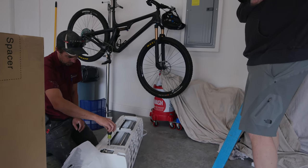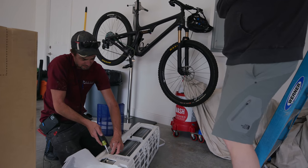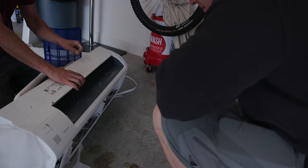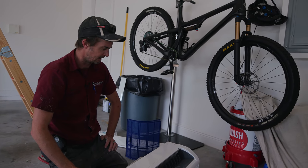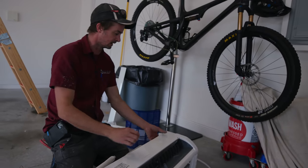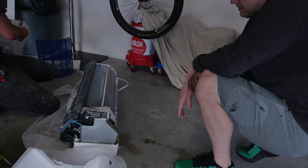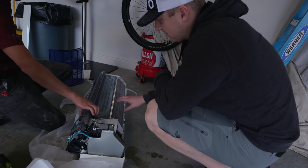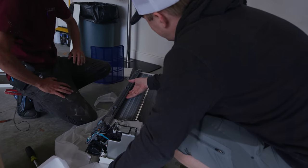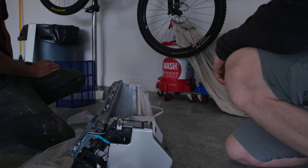You've got those two little filters. What clogs up on these things all the time? The drain line, the blower wheel — that usually happens after about two to three years. If you look right through there, you can see the little black wheel in there. That'll get a little caked up after a couple of years, so they say pull and clean that once every two to three years — you have to take the whole front cover off. There's the evaporator coil, then you've got the drain pan right here. The drain pan fills up and spills over if the drain line gets clogged. Other than that, there's not much to it — nice system, very low maintenance.